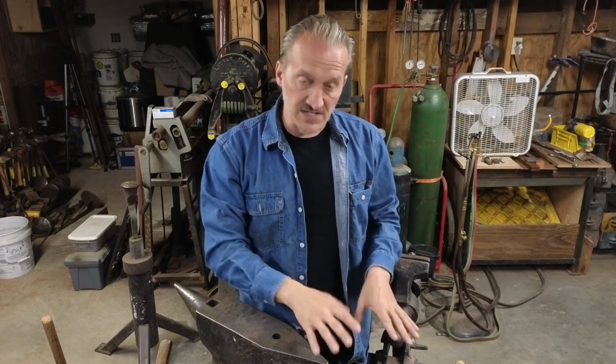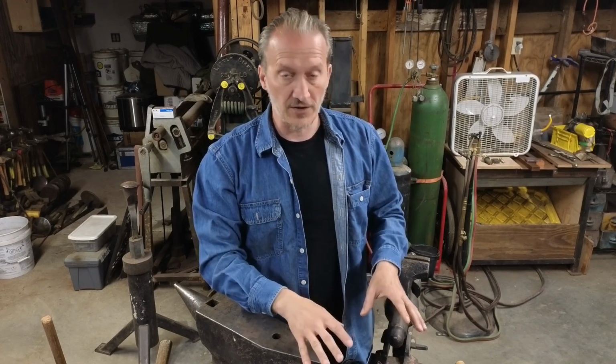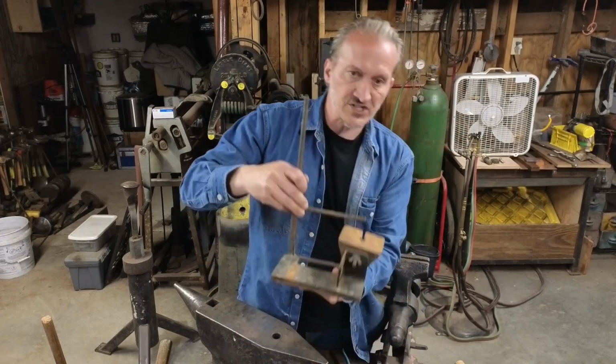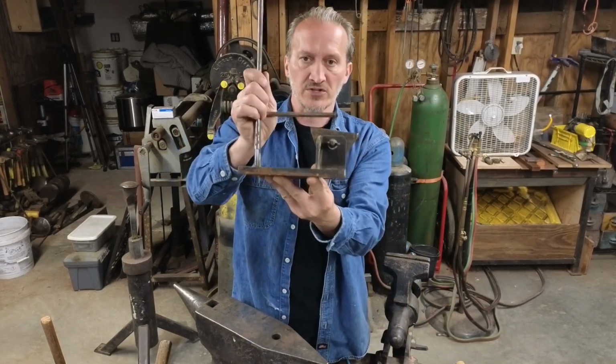If you pitch it just slightly, based on the thickness of the blade and the thickness of the material, you can actually have it so it creates a scissor action when you pass it through. And that's how these things work really well on thin material, is by having that little bit of a set to them. Years ago, I made a jig based on one that was available commercially.